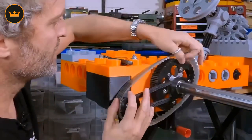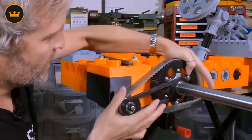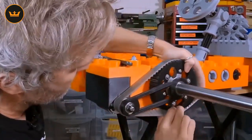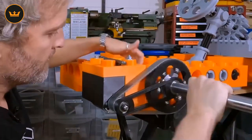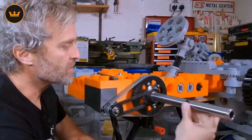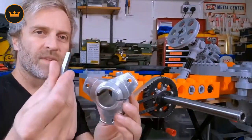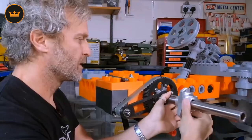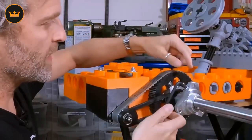Let's start with the back end first and then just wind it over the larger pulley wheel. There's another little spacer that goes onto the axle — all I need to do is put the rear hub on with the key way and then tighten up this bolt here, which stops the hub from sliding off the axle.